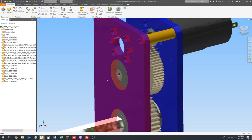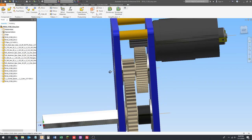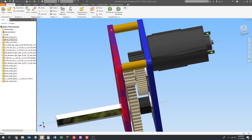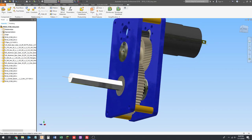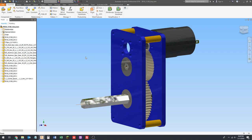Also, the end of the tap is tapered, so the last couple of threads might not be fully formed, and you might not be able to get a screw in there. Like I said, it's so close, I think we could use a half-inch fastener in this hole and be okay. But I would feel more comfortable going for a shorter fastener. I think we'll go to a 3/8 fastener here just to be sure that we don't bottom out the threads. It's good practice not to use longer fasteners than you have to, and if you really want to convince yourself of that, just tell yourself it weighs less, which it does. It's just not particularly significant.